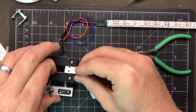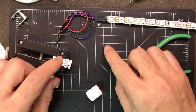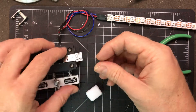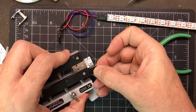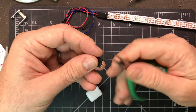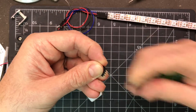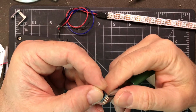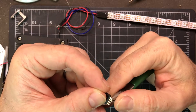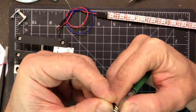Put this in the vise like so. But first we need to prepare this little connector — you'll notice the spacing is too wide for the holes. So what I need to do is narrow them down a little bit. I'm just going to use the pliers to bend them in slightly and try to straighten out until the very last moment.